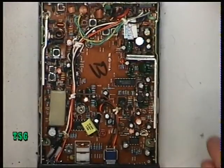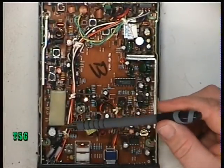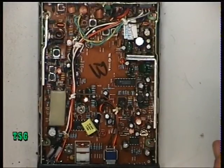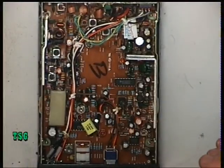Whether or not that works in theory I don't know, but I've not heard that story before. There are two coils in the VCO and they're a bit of a swine — you've got to hope they don't need adjusting at any point or you're going to have trouble getting that wax out. So these sets can suffer from dry joints. It's about 28 years old now and hasn't been used for the last 16 years, so we'll see whether anything has played up on it.